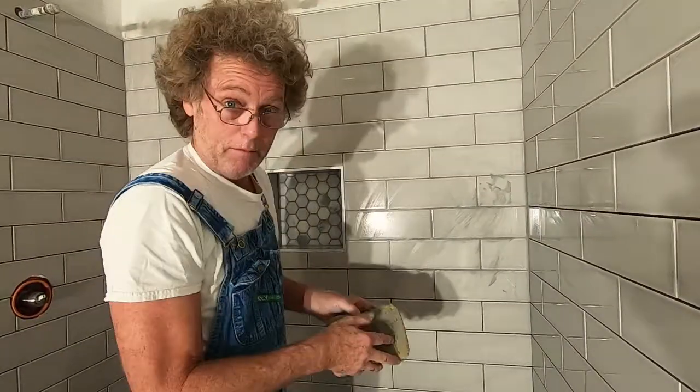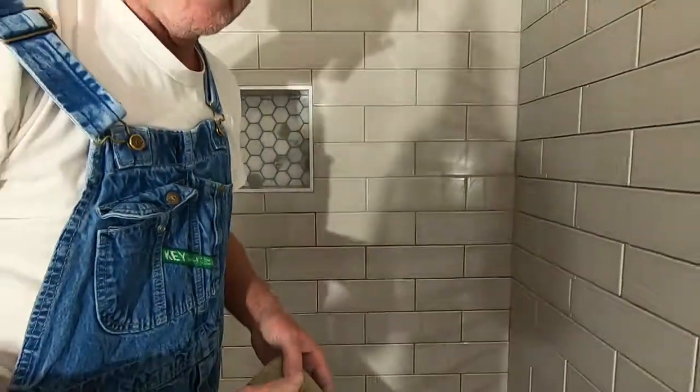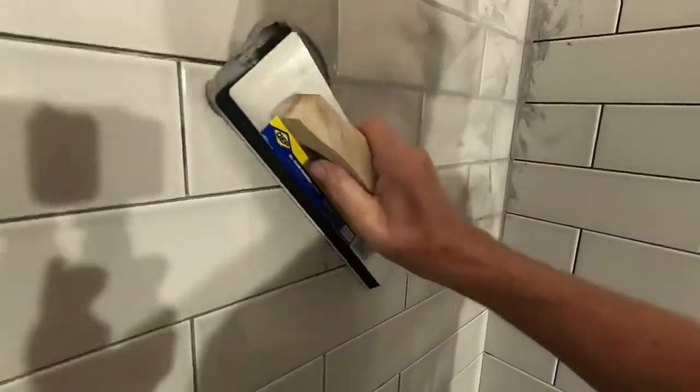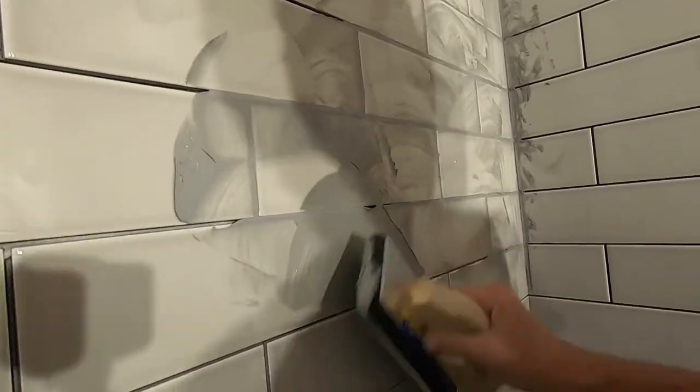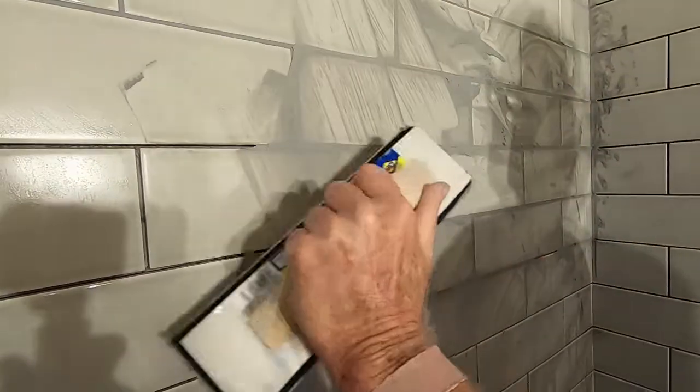Ain't no big secret to this. Fill the holes. And I'm checking out these grout lines, just like a bricklayer would break the joints on this wall. The same thing when you put the grout in the holes, you know, at an angle. And you wipe it. Pay close attention to the corners, so you get them packed solid. You see how this is? It'll come at an angle. And you need a relatively wet sponge for this. You'll probably wash it 5 or 6 times. You see this when you're grouting? I'm making a conscious effort to push them joints full. Turn the radio on and chill.